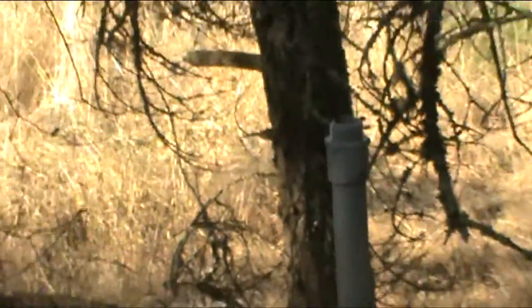And this is my fish tape. This is a 65 foot metal fish tape. I push that through so the conduit goes underneath the driveway. It comes out over here. This is where my box is going to go. I'm going to have a 2x6 pressure treated post coming up, going to be buried in here to hold that guy.